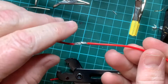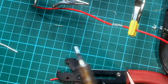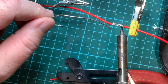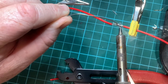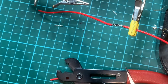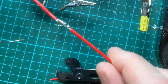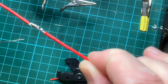And then we're going to solder this together. I'm just going to place it back in my helping hands. You'll notice that the wires hold together in a nice straight line. Then I can actually heat up the join — because it's been tinned, it makes life a lot easier. Then just add solder. And we're done.